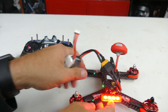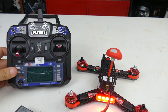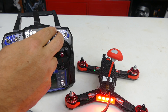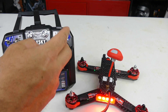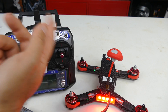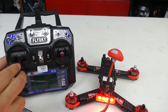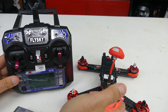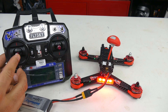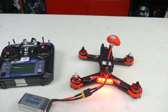We'll arm it for you. This switch on the top is our arm switch, and this top switch cycles through the different flight modes — from self-leveling, to self-leveling with acro capability, to full rate mode where most people end up flying. Going full throttle down, the motors cut all the way off. Some people don't like that and prefer an air mode to give a little softness in the drop, but these ones do turn all the way off when you throttle all the way down.